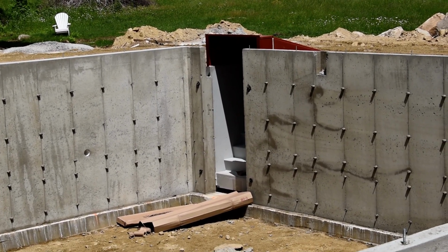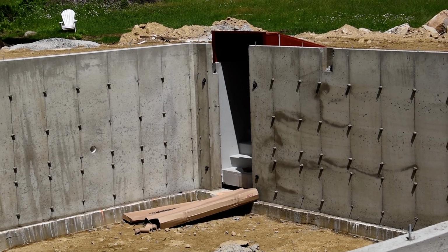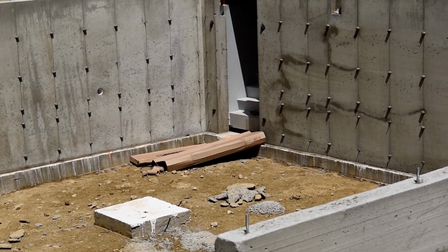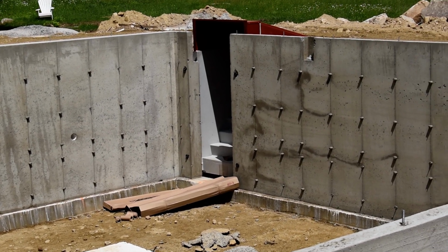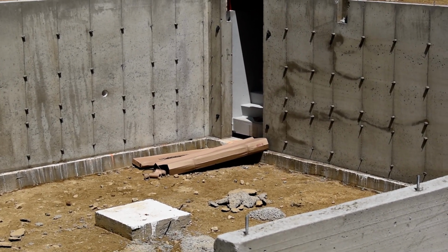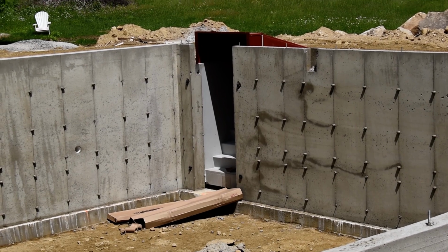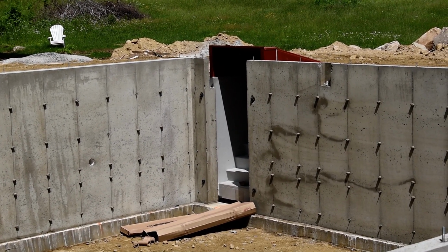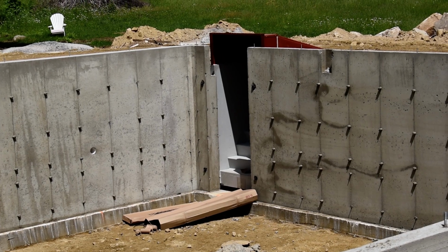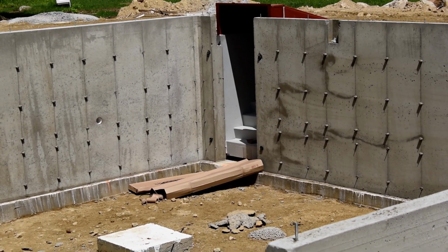Now underneath, we're going to be doing foam, isolating the footing and keeping the slab warm, essentially. And so that is going to continue and be a thermal break under that final step there. That's why you see the gap there. So foam goes under there, and then they pour on top of that to top off the slab, so that when you're done, the slab will go a couple of inches above the bottom of that last step, filling that gap in right there. So all the steps coming down are the same height, and then it'll be the same height down to the basement floor.